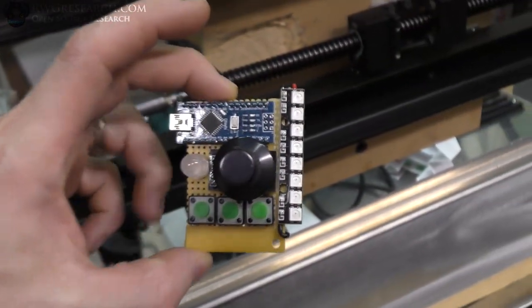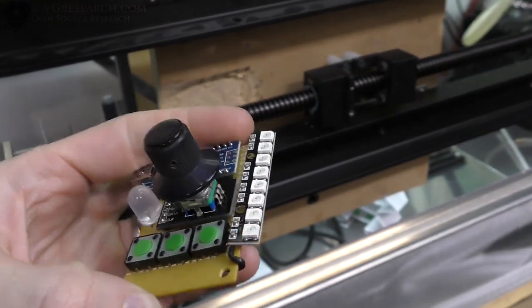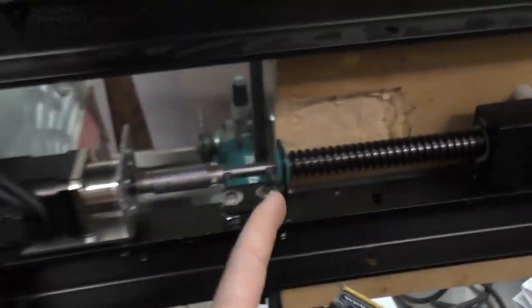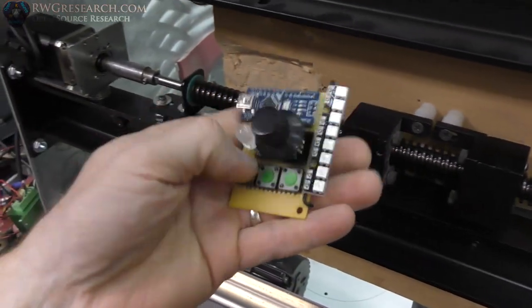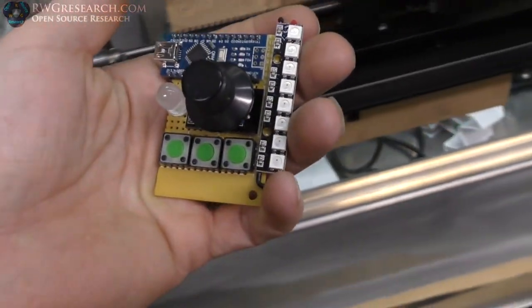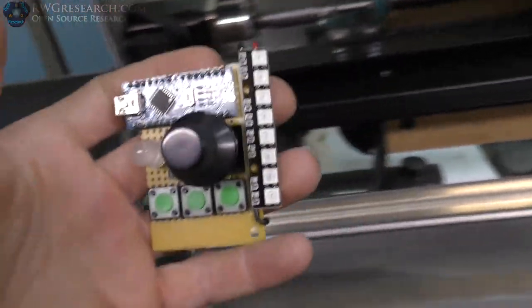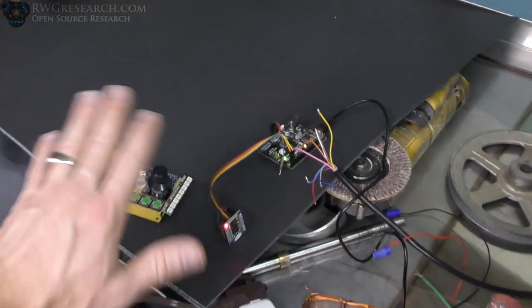Then I spent days building this — it's a pretty cool open-source project but it's about 6 years old, just demo code. It lets you turn an encoder potentiometer to control speed or position depending on whether you click it. You can set an in-point and an out-point, so basically scroll it over to wherever the end of my prop is, hit the out point, hit a button and it runs. This could basically be controlling a camera slider. But this code doesn't work — I even bought these LED modules for 6 bucks on Amazon and there's something wrong with the code.